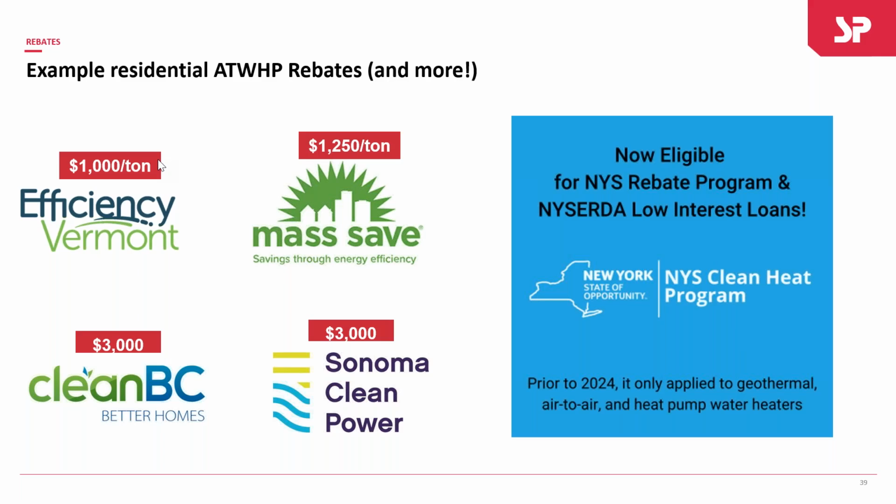A lot of times the devil, so to speak, is in the details and the terminology, right? When we look on the right here, prior to 2024, New York's heat pump rebate only applied to geothermal, air-to-air, and heat pump water heaters, right? Air-to-air meaning your standard outside condenser, if you will, right? Or matched up ductless mini split, that type of situation. Well, they're finally starting to include air-to-water heat pump as a viable heat pump option.